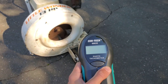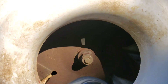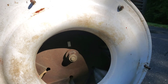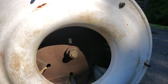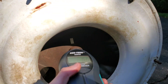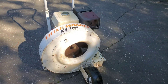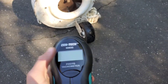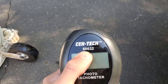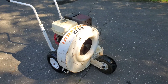You should go out and buy one of these tools — this one was like 40 bucks. It's a digital tachometer. How it works is you stick one of these stickers, which comes with it — it comes with a ton of them — you stick one on whatever is spinning or whatever you want to test the RPMs on. In this case, that's the blower right there. This thing shines a little laser light — you can see it — you shine it right at the sticker while it's spinning and it'll read the RPMs on the screen. This is a Centech brand I got at Harbor Freight for about 40 bucks.